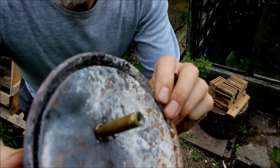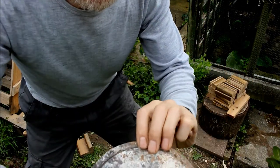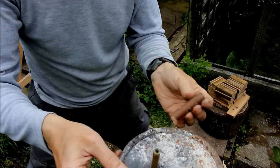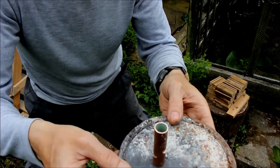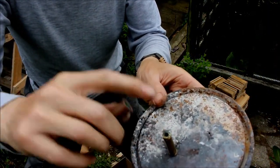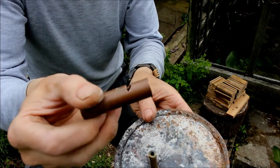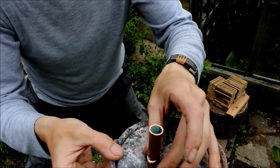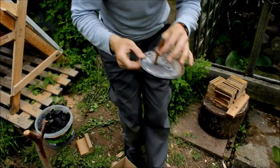So that's the little pipe I've put on the top, and I've just pinged it over on the back side. Instead of that gas going everywhere, I can contain it out of this hole. Due to the air and gas escaping at high velocity out of that hole, it should drag air in through these slits I've put in, and then hopefully I'll get a little flare stack that will maintain its flame.